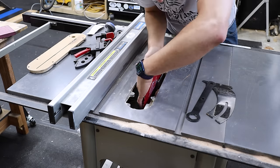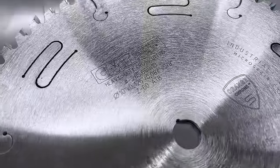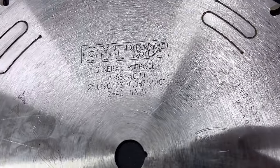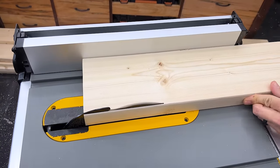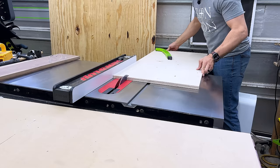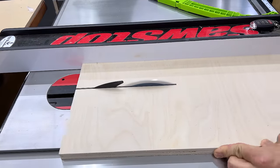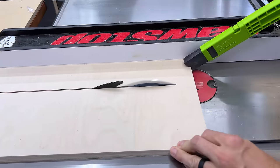I ran them for years on my old Delta table saw. The one I really go with the most — the one I think most people should buy — is the CMT Chrome Edition blades. I've been running these for a couple of years now, especially a good 50, 60-tooth or 40-tooth all-purpose blade. These are fantastic blades. In that 40 to 60 tooth range — kind of a combo tooth — you can do cross cuts and rip cuts and not really have to worry about much tear out. If you're doing a lot of cross cutting or sheet goods, then an 80-tooth would be better, but for most of us the 40 to 60-tooth range is perfect. I usually keep a 40 to 50-tooth blade on my table saw.